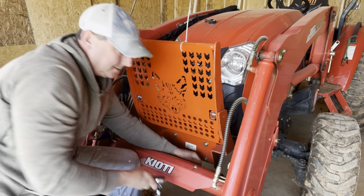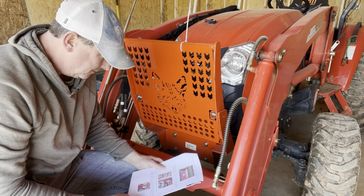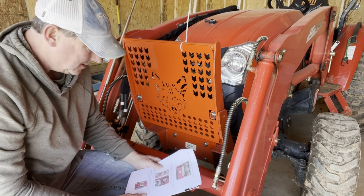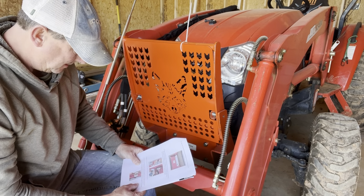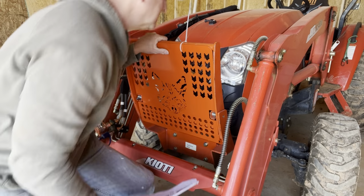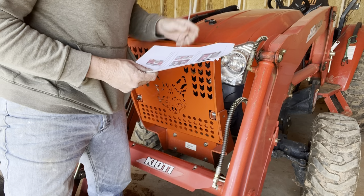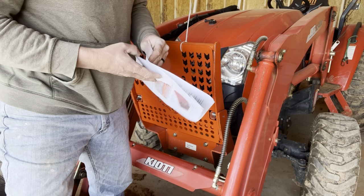There's that. Now what's up? Remove the zip tie, position the top of the insert so that the small gap is between the... so you want to make sure the tabs are on the inside, which they are. So the mounting tab should approximately align with the back of the upright in its position. So the tab should be flush with the back of the frame here, so it shouldn't protrude forward or behind it at all. So I think I'm ready to drill it out.